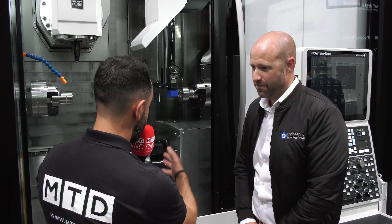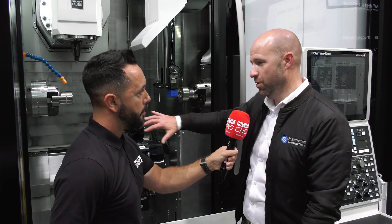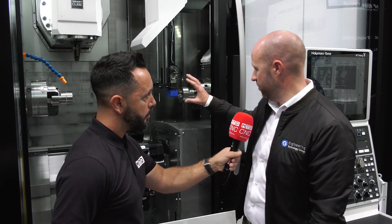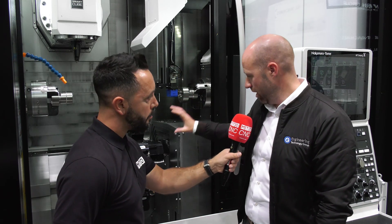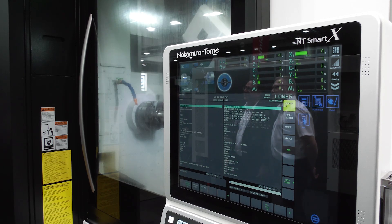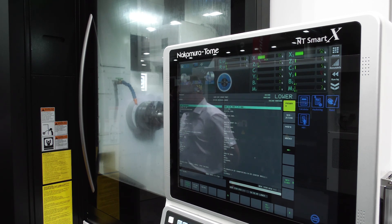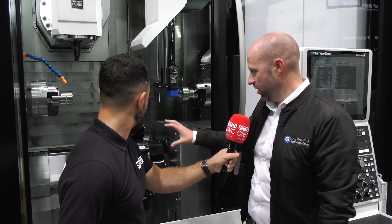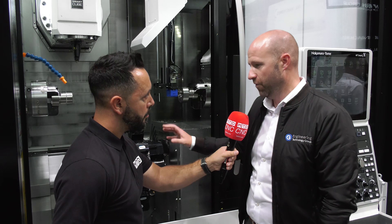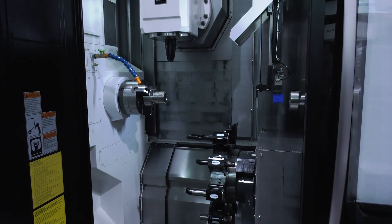When we're working on a 250mm squared envelope, we've got two and a half tons sitting behind that Y-axis driving it — capabilities are endless. Now this machine is the standard version with one bottom turret. Each sub spindle, upper turret, and lower turret all sit on their own independent slideways. Therefore you can share operations between the main spindle and the sub spindle without compromising machine performance — roughing on the main and finishing on the sub spindle.